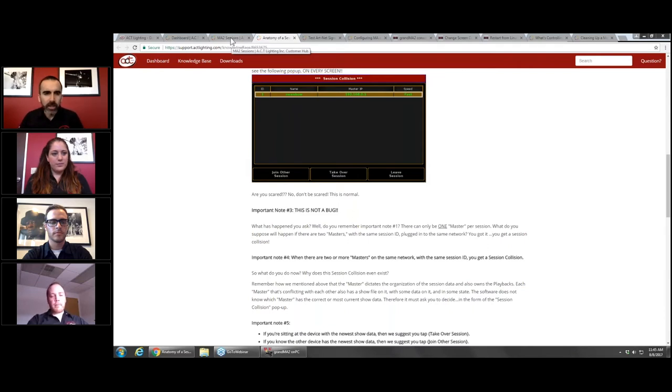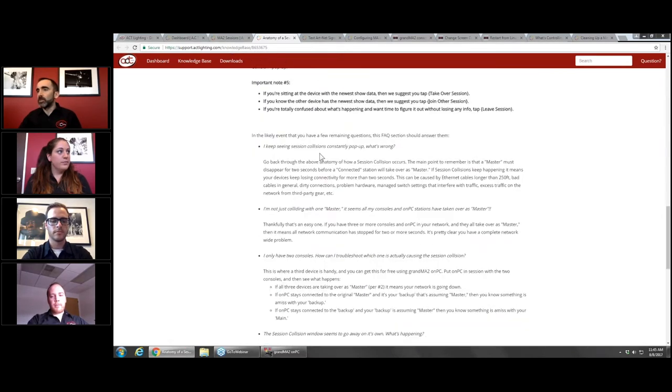There was a question from somebody who is getting constant session collisions. Guess what? That's in our FAQ section down here. Constant session collisions mean that the two devices that were in session have become disconnected for 2 seconds or longer, so they both take over as master. That could be a bad cable. That could be traffic shaping or throttling through the managed switch. That could be maybe a dirty port.